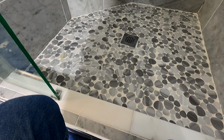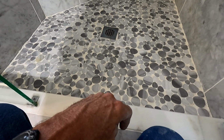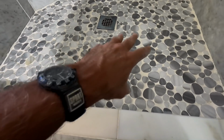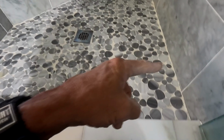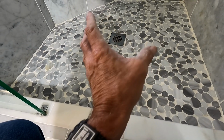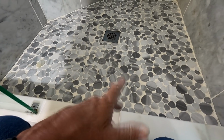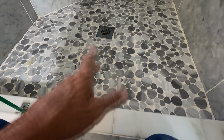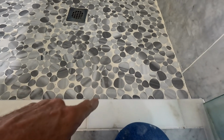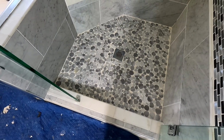I've maybe only twice ever been able to just take care of a tear where I knew it existed, and do what I'm proposing to do now, which is get all this mortar and all this tile out of here without touching the wall tile at all, and literally refashion the drain, patching in, overlapping another pan liner over what's currently there, tearing out what's bad, and putting a new drain in, and just retro-fixing everything after the fact. And then pour a new pan up to about the same level, and we're going in with a hexagon marble tile rather than this shaved rock tile. It takes about 3 days to make this happen if it works.